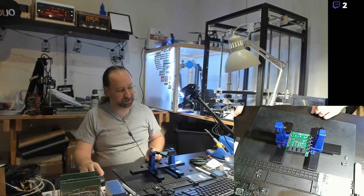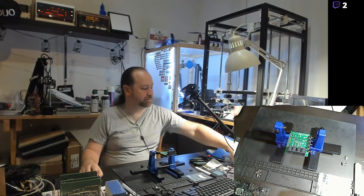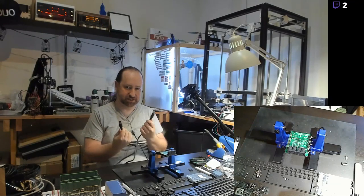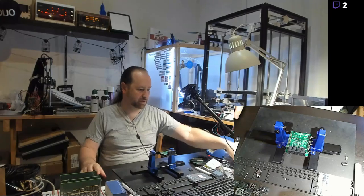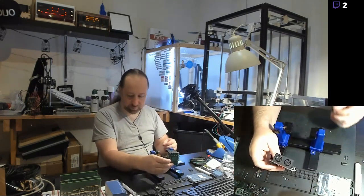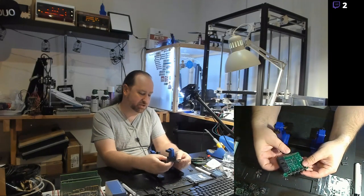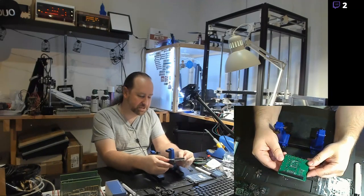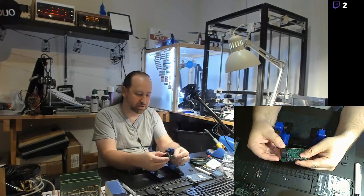They are not audio plugs. They are 6-pin DIN for serial cable for Commodore peripheral devices like floppy drives and printers. The board is a floppy drive emulator, a daughter board that goes on top of a Raspberry Pi. I had the boards made by a place in China called PCBWay, and bought a bunch of components to solder on, and I started soldering them together tonight.